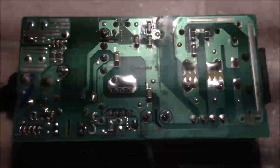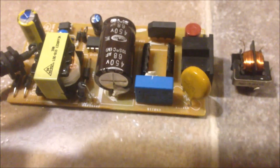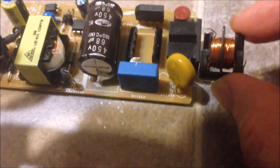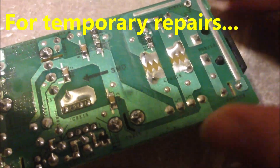I think it's repairable, and we're going to try to find what the problem is. I found out this is the first inductor for the EMI filter, and it's a three-connection broken off, and also the plastic housing is broken off. So we just take it away — this is for filtering. The power supply will work without it. Of course, if we can find a good one we can replace it, but we can just connect this pair and this pair and it should be fine.